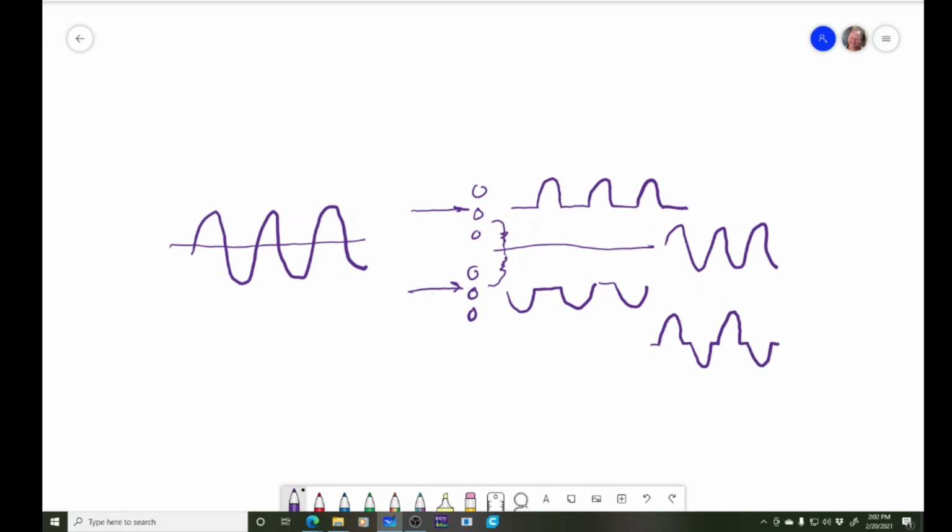And this amplifier has a potentiometer for adjusting that amount that goes to one bank or the other bank. And it looks like in the newer version, that adjustment was made by a transistor circuit, but this older one has a potentiometer. I took that potentiometer out and I put in a little bit of a nicer one, but I'll just show how to adjust that.